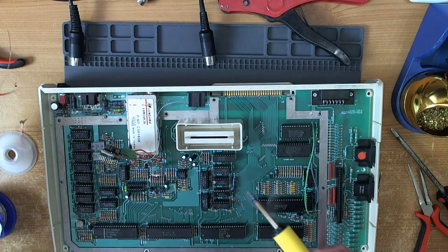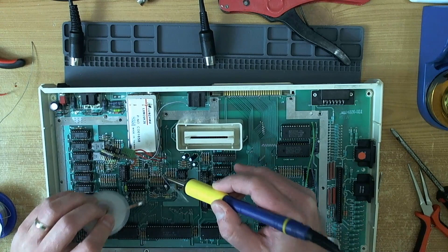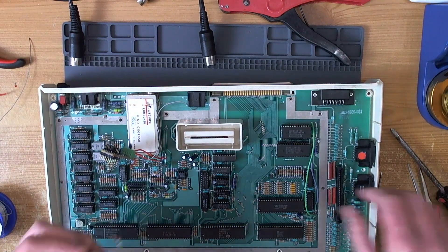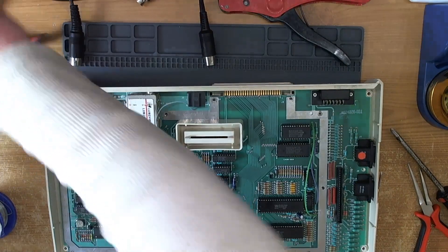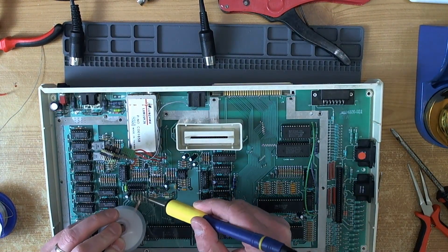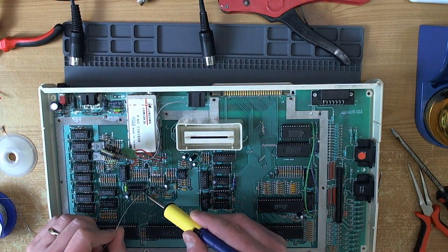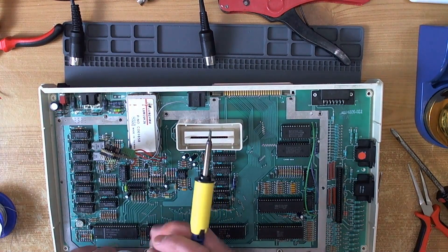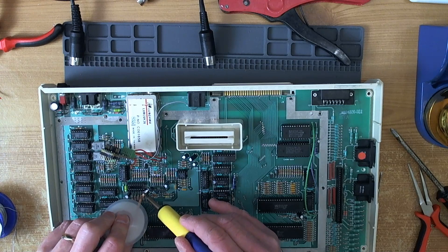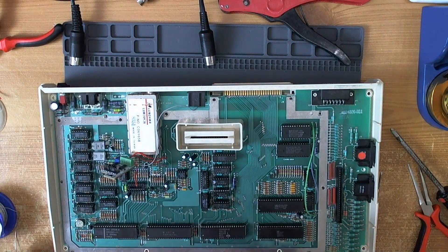I'll add a bit of 60/40 and get this stuff off. That's more or less sorted. Let's remove some of this solder residue at the bottom where the ground wire is connected - which isn't really needed anyway because the device is already grounded on the socket. This solder is very weird stuff, some sort of alloy. If you can't get it off, add some lead solder - mix the two together and it will soak up nicely into your wick. There we go, that's better.